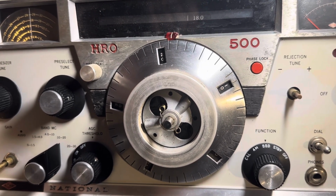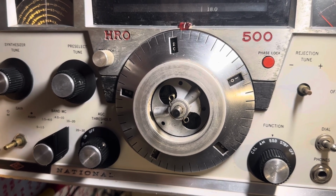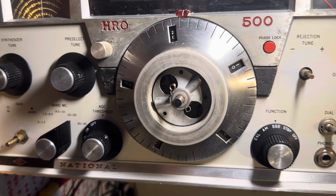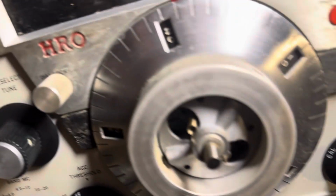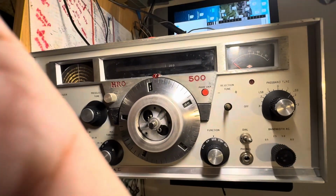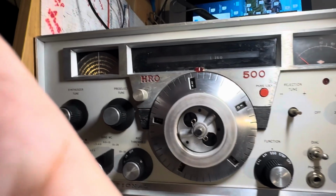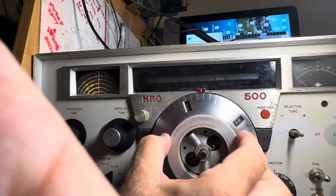It basically had a bad mixer transistor and it probably needed aligned. And this might have needed cleaned up also. The transistors were needed reseating. I reseated all these. It took days for me to figure out this radio. Why? The documents are good. It's just a hard radio for me. All right, that's it. We're locked. We can do things. We can hear FT8.